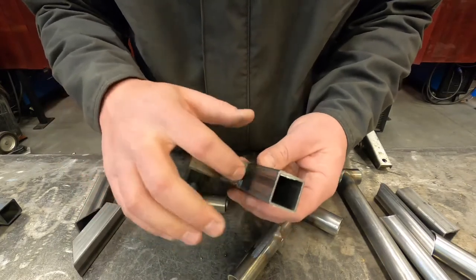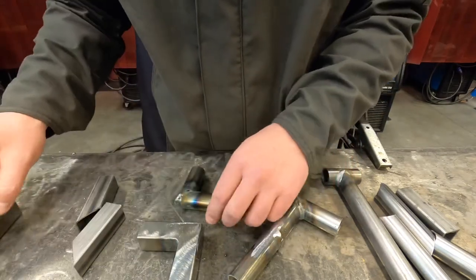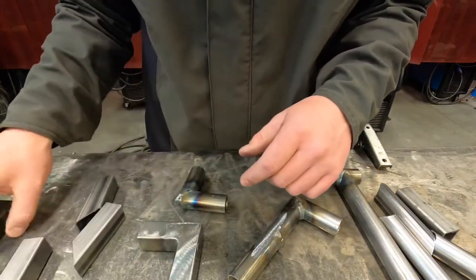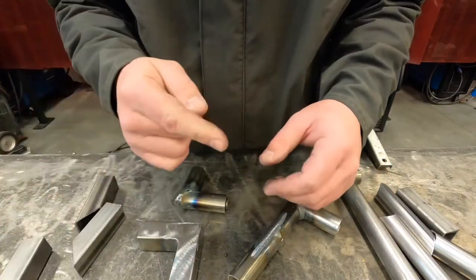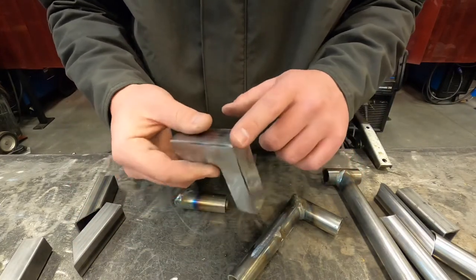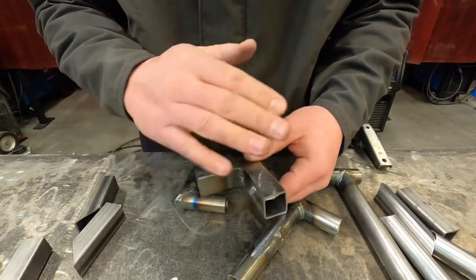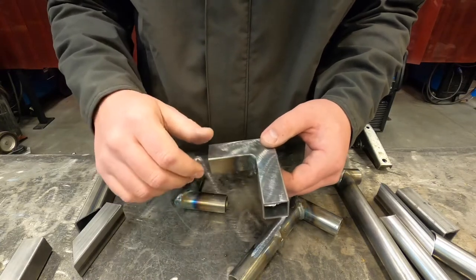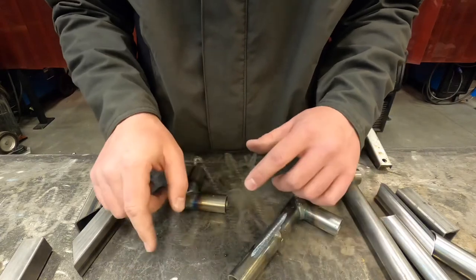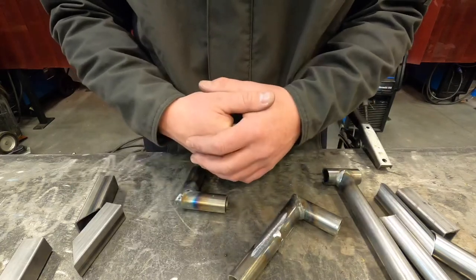Your inside corners on your square tube corner joint or T-joint — and sometimes even the butt joints — they lay down a little bit easier. On inside corners you can do some movements, because chances are we're not going to be grinding the inside corner — we're just going to be grinding the outside edges. If we were to grind the inside corner, that can cause issues in itself. We'll get to that when we get to the grinding.